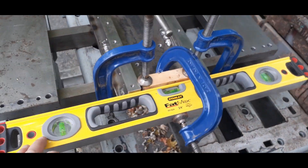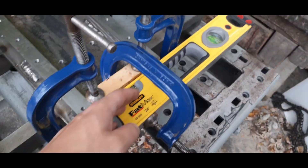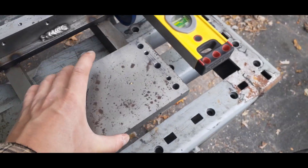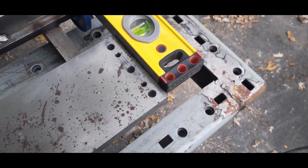I have this 24-inch level just lightly clamped. I put this piece of wood here to add a clamping spot for the C-clamp, and it's very lightly clamped so we don't distort it — there's a gap in the center and that'll be used as a reference edge. These plates haven't been welded on yet, but they'll be butted up against this face of the level, which is reasonably straight for this welding application.